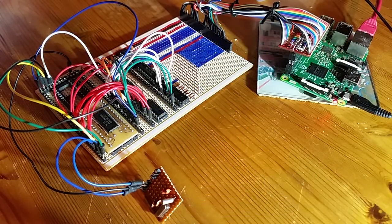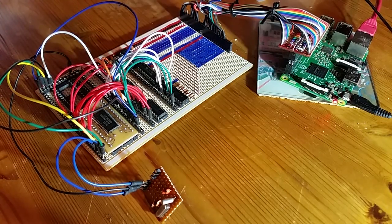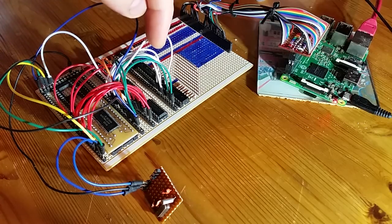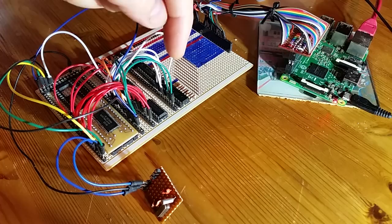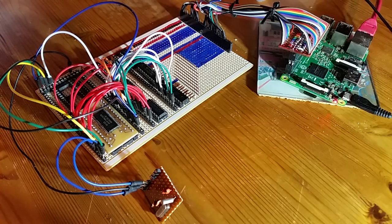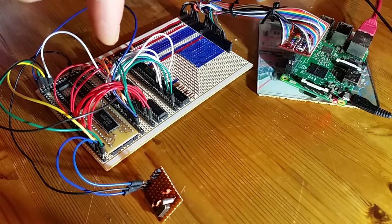This is the hardware I've put together to read the memory chips. I've got a Raspberry Pi over on this far side, and I'm going to write a Python script on the Raspberry Pi to read the contents of the memory. The memory chips I'm reading are 5 volts, but the Raspberry Pi IO lines can really only use 3.3 volts, so I've got some integrated circuits in here to adapt the signals going between the memory and the Raspberry Pi. I've got two data buffers and transceivers so they can receive and transmit data — both 8 bits each, giving up to 16 bits.